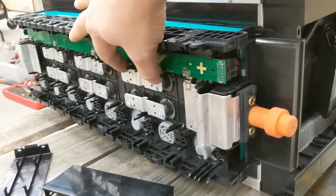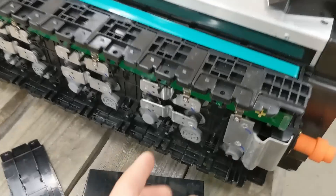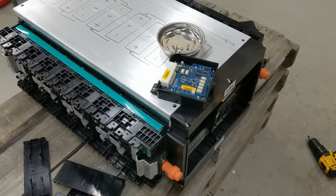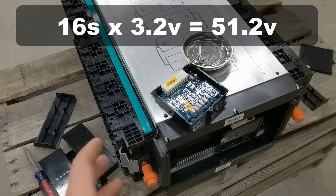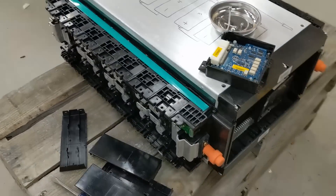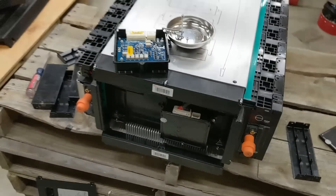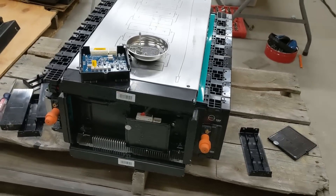What I love is the size of these bus bars — you can tell this thing was made to carry serious amps. Each cell has a nominal voltage of 3.2 volts, so this 8S configuration is perfect for 24-volt setups. If you series connect two of these you create a 16S module giving you a fantastic 48-volt setup. These are priced at $100 per kilowatt hour, which is a really good price. Head over to batteryhookup.com and use the affiliate link in the description — it won't cost you anything extra but helps me make more videos. Thank you all very much for watching. Bye.